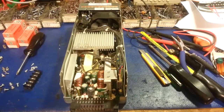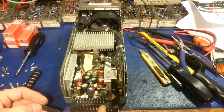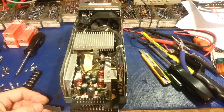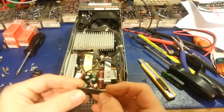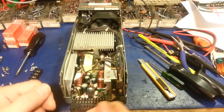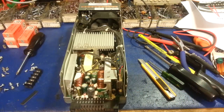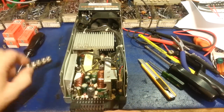You're left with this edge connector. I've already cut the top of the plastic enclosure out — I came in with diagonal cutters, cut a slit on each side, scored it with a razor knife along the back edge, and snapped it out with pliers. That gives me access to the pins I want — the 12V and ground pins. Now, how do you hook up to that? You could shove wires in there, but terminal strips are very handy, so that's what I'm doing. I buy them by the bar in foot lengths and cut them down to whatever length I need.